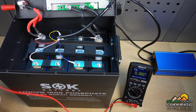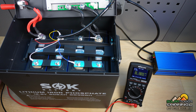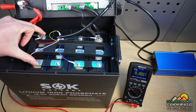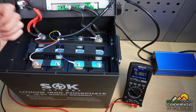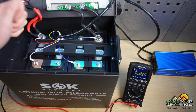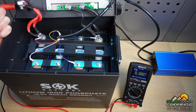The charger by the way is still connected, so this is where it sat dormant. But when it was charging, this battery here did shoot up to its disconnect voltage. But I think seeing as the battery is no longer taking any juice in, the BMS has done the disconnect, and the battery voltages have settled down to a stable state of charge voltage.